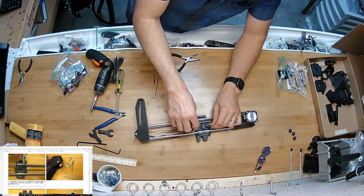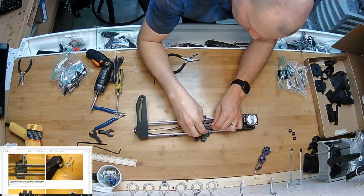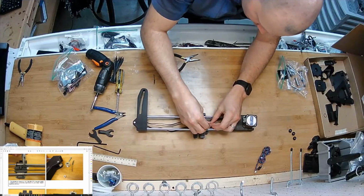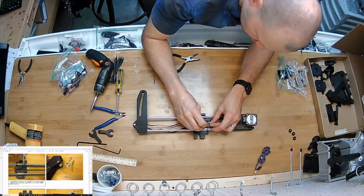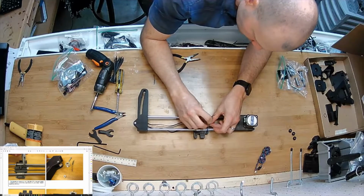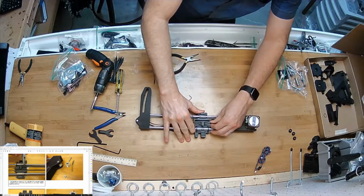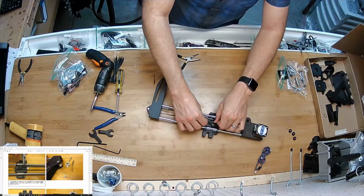Now these little slots that the belt gets pushed into, I'll use this little tool here. Those slots are tapered, so I'm going to push it in all the way to the bottom, or as far down as I can get it, because everybody's 3D printer is a little bit different. The weather and the filament could affect it, so you're trying to squeeze something that's small to accommodate the variance that's going to show up. You've got to have some taper. There we go. And now when I try and pull it out, it didn't come out. It's perfect. So yeah, provide a little bit extra on the belt.